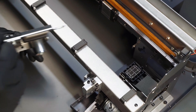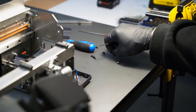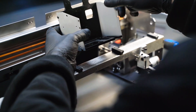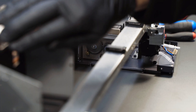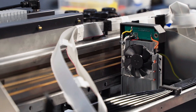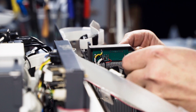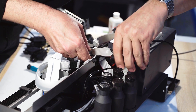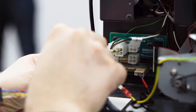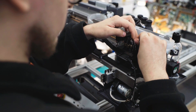A wiper unit is fitted in a cleaning station, where the printhead will stop for removal of ink. The carriage is installed on the precise linear guide. Electronic systems and an ink supply system with a UV lamp used to cure the printout are assembled in the carriage. The printing section is then fixed to the base, electronic systems are connected, and the ink supply system is attached to the head.